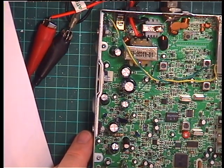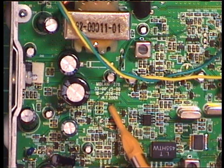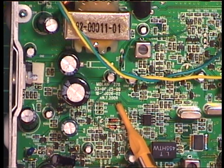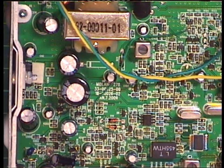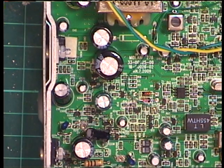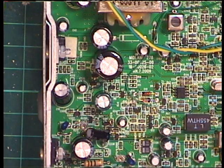And it clearly says on the board, Midland 278, January the 7th, 2009. So considering the 78 Plus Multi was, I think, 2015, 2016, something like that, this is like the early version, so they must have adopted this when they brought back the 78 with its blue display, and they must have discontinued this. So although this is new old stock, I suspect it's about 2014, and the board design is 2009, so I'm not expecting it to do things like AM CEPT in UK mode, because it's before that licensing change happened. So we'll get straight into this, and we want this on the UK channels.